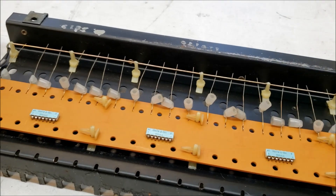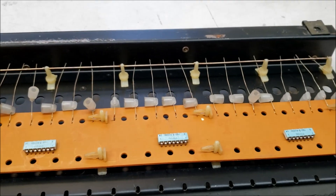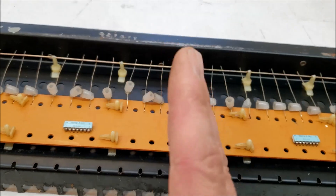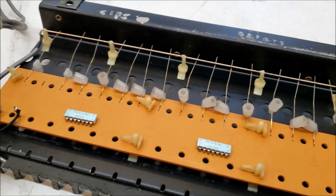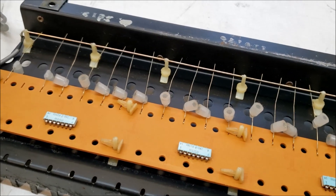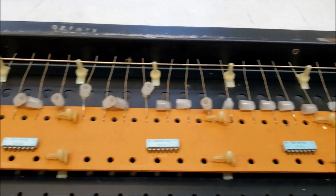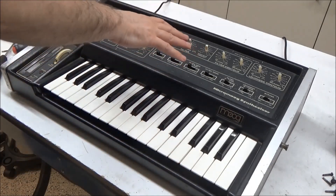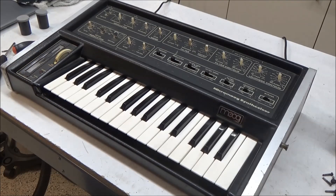There's only one bus bar, which is actually kind of interesting on this synthesizer. On the ARP Odyssey you'd see two bus bars — one for the control voltage, where there are resistors between each of the J-wires so when you press a key it knows the control voltage of the lowest key pressed. But this is interesting because it also injects a 25 kilohertz triangle wave, and by detecting that it can extract the gate and trigger information without the need for a separate bus bar. I finished with the key bed and calibrated the synthesizer, put the circuit board back in, closed it all up, and then a new problem presented itself.